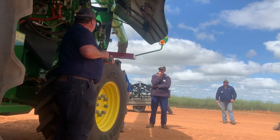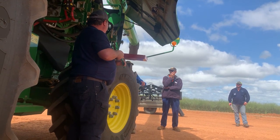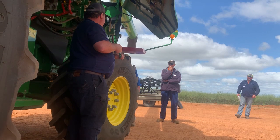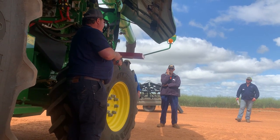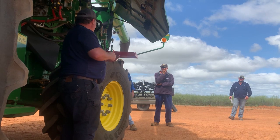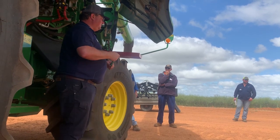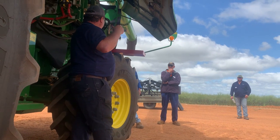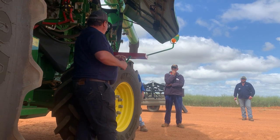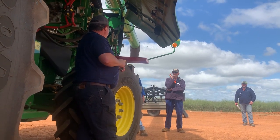They seem to do everything pretty standard across the board, and they like to do that so that if you've got problems, then they can sort them. So it's pretty fair to say that everything that's sold is all the same, and unless you really push them, they don't tend to change them out of those orders. If you go to the spare parts manual, it will say a standard Aussie concave. So that was 31, 25, 25. And that is something that came from blokes the same as me 20 years ago that ran around with the concaves and did some tests to see which one performed the best. And they came back saying, yep, 31, 25, 25 works. And that got spread out through the dealerships and they said, right, this is what works, and then go with it. If you want to order a machine, you can order it that way.